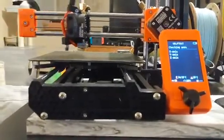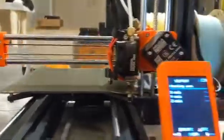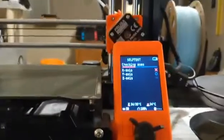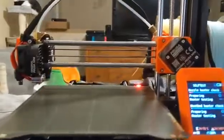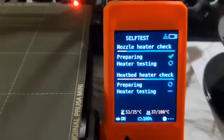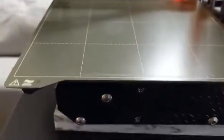Moving on to check the x-axis. Failed. The x has failed and now the y has failed. Now it's doing a nozzle heater check and a heat bed heater check, which those will pass just fine. I think part of the problem has to do with how far out the nozzle is coming for the x-axis and maybe potentially how far out the y-axis is sitting for the bed.